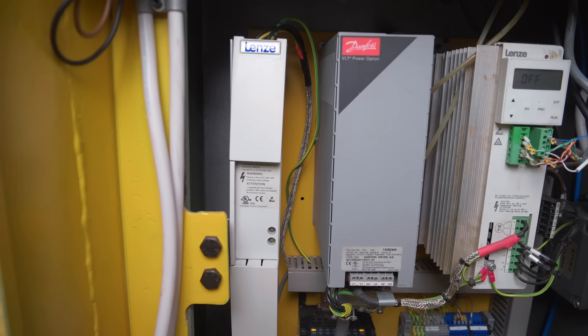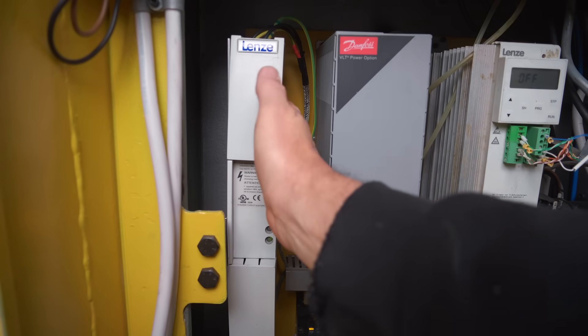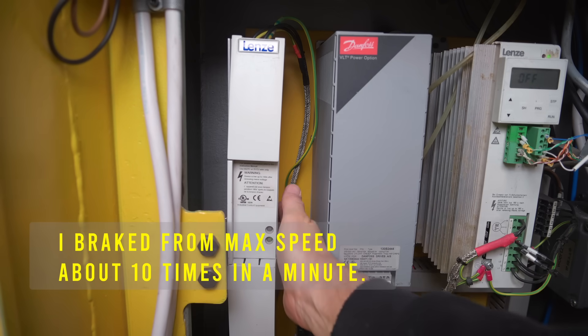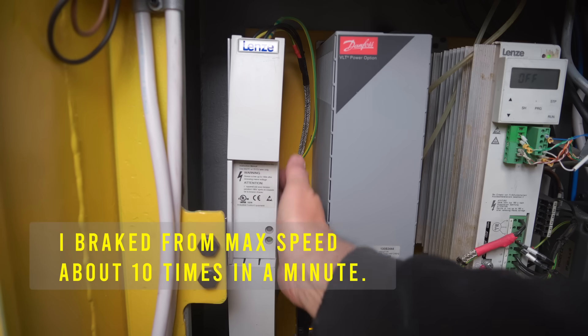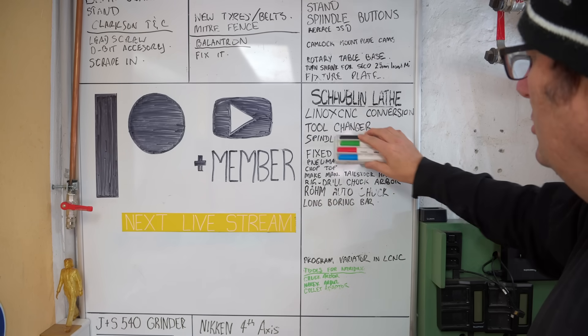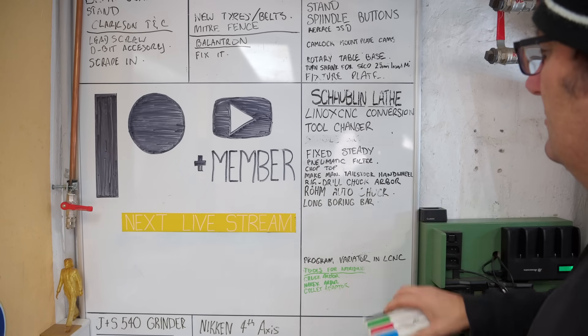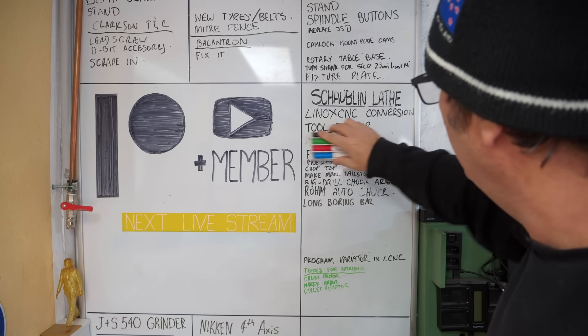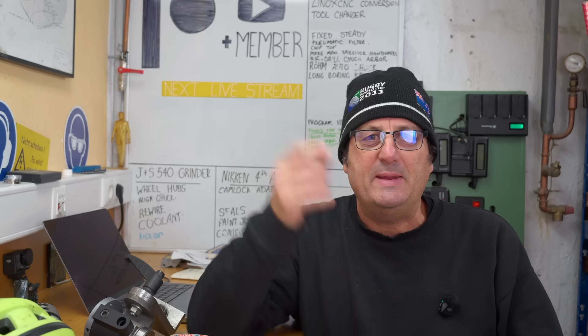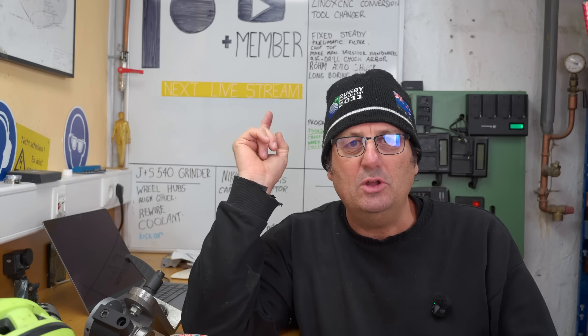I got the expected comments that I probably shouldn't put the brake resistor inside the control cabinet because of heat, but it's actually generated almost none — maybe a two or three degree temperature rise, five max — so I have no concern about that. I'm really happy that I've got that brake working; it's another thing that's been hanging around on my list for way too long. Thanks very much for your help, and don't forget to stick around for the next video.